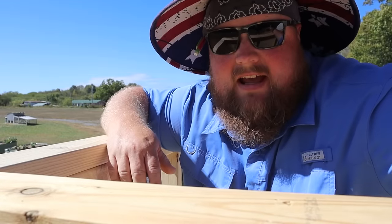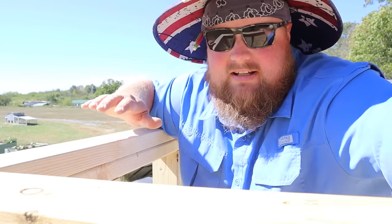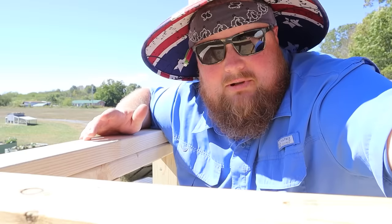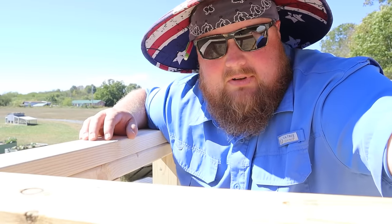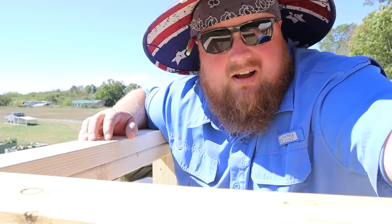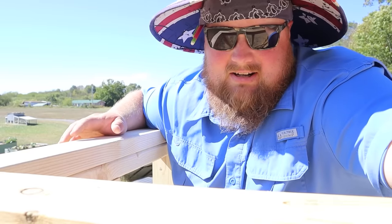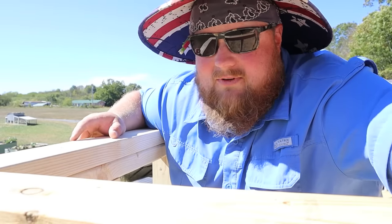As you guys can see, having the scaffolding out here is pretty handy. It enables me to literally just roll around, nail this down as I go. If I didn't have the walls braced, sure, I could be rolling around here like, I don't know, a guy on a scaffolding, but the walls have to be braced. That's all right though, it makes it easier. I did not have to get down and up for this whole section, and that makes the job go a lot quicker. Plus, I can have all my tools here on the platform and not drop stuff, or have to go up and down, and that saves a lot of labor and makes for a happier, more enjoyable time.